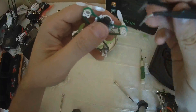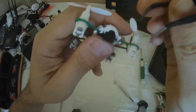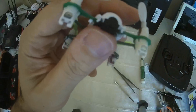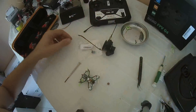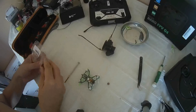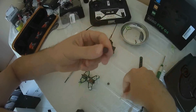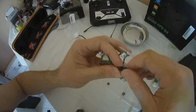After gently removing the glue — for me it was on the bottom side — I managed to gently turn the lens little by little and remove it by spinning to the right. Remove it gently with small tweezers without damaging the external plastic lens. Then try to insert a new one without introducing any dust — use special lens cleaning tools. I'm installing a 120-degree field of view lens. It should fit the thread directly, and I hope there will be enough clearance to tune the focus correctly.